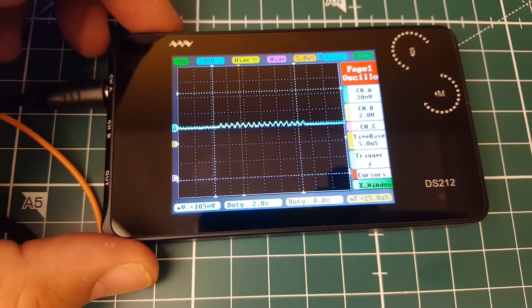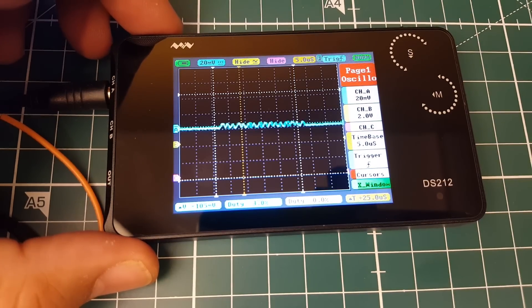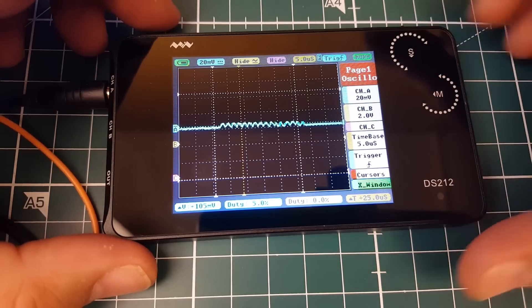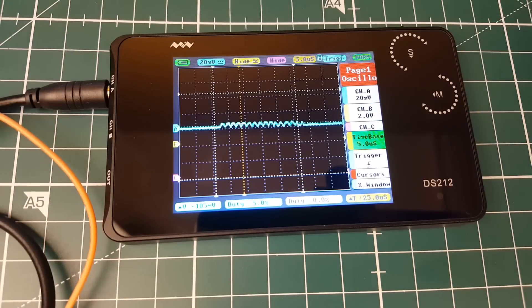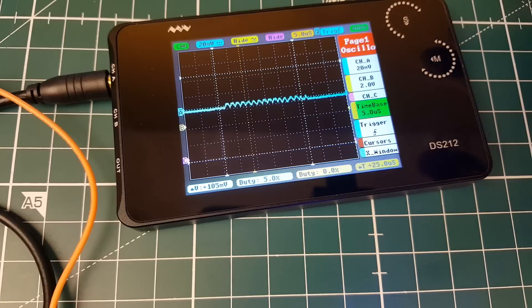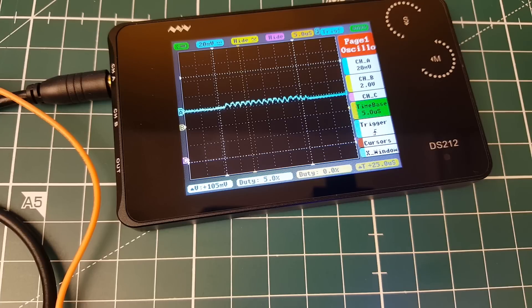Let's pause and take a look. I'll increase the speed. It's pretty good but not 100% readable. Right now this is zero throttle, this is full throttle — you can see a difference. Moving slowly from 2000 down to 1000, down to zero, and back up to full. It's seeing something and working. You can measure and see if your signal pad is broken on your flight controller — that's a big plus. Later I'll show how to test for bad ESCs and motors.